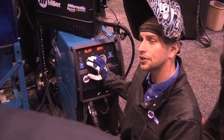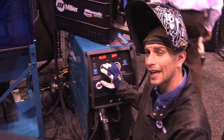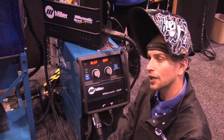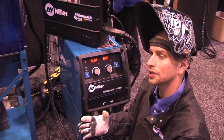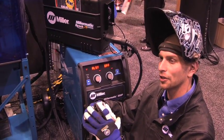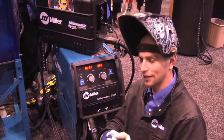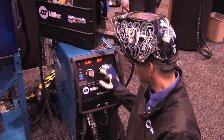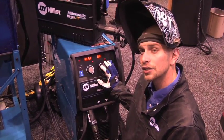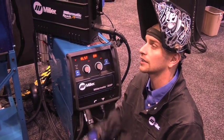You also have Lumistart. This comes into play for heavy plate aluminum — you're doing a lot of half-inch, heavy, heavy stuff. On aluminum, the start is what's cold. Usually you start out with a big ball of aluminum wire at the start, get halfway down the weld, and then it finally starts wetting in and looking real nice. With Lumistart, depending on the heavier plate, you can turn it on and it's going to give you extra kick right at the start and make sure it washes into the start.